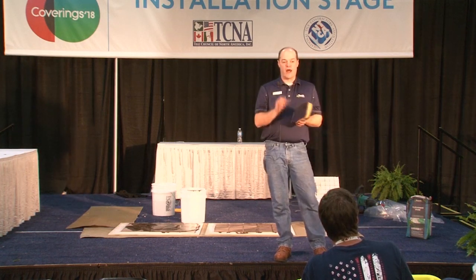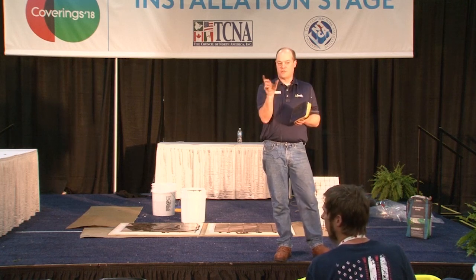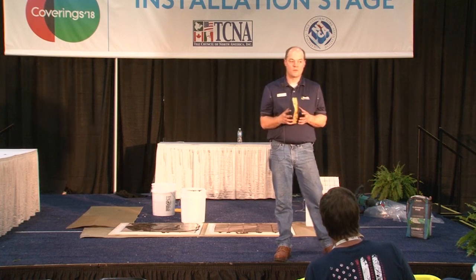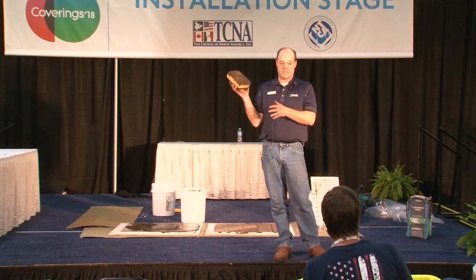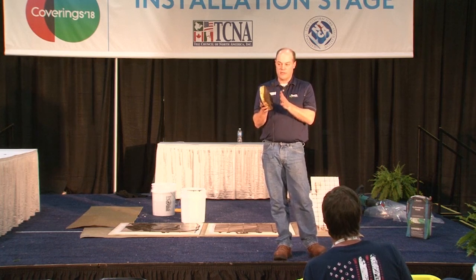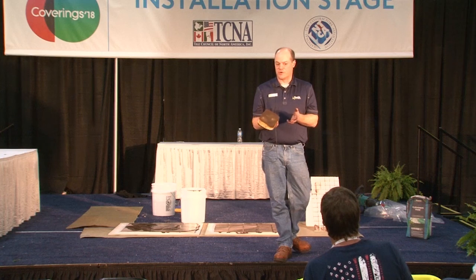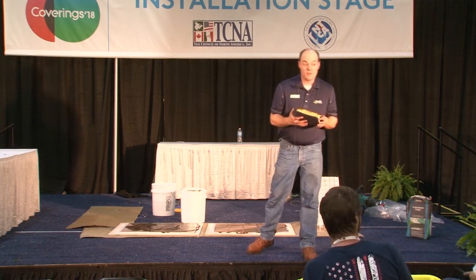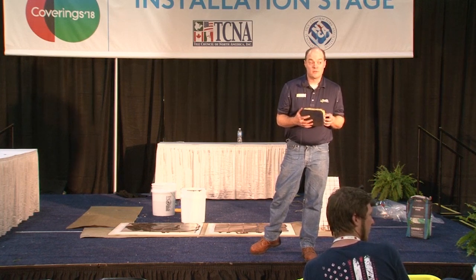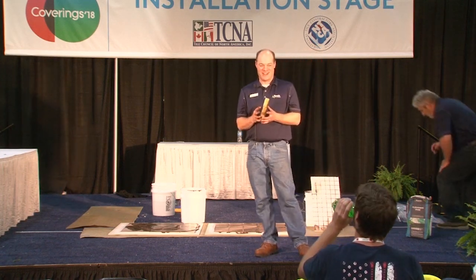It's considered a sanded product. It has a very small micron sand to it, so it'll go from a 1/16-inch joint. Right. 1/16 is a minimal standard NTCA minimum for grout joint on tile, so you can basically cover the gamut. Not too many instances where you see a 1/2 inch or bigger grout joint anymore. That has to do with the curing process of it.